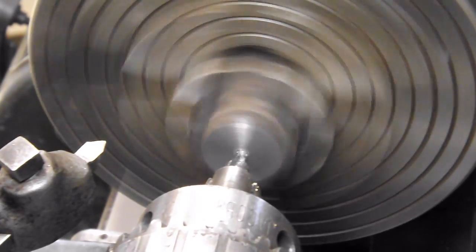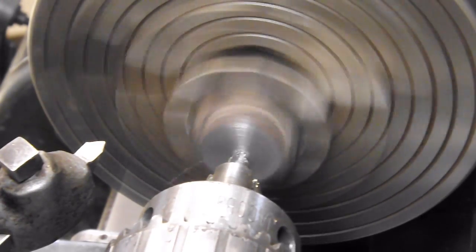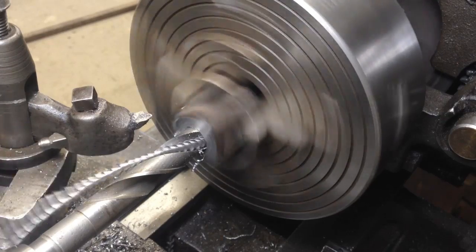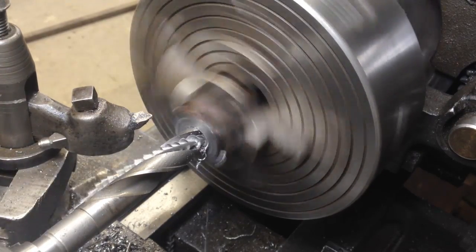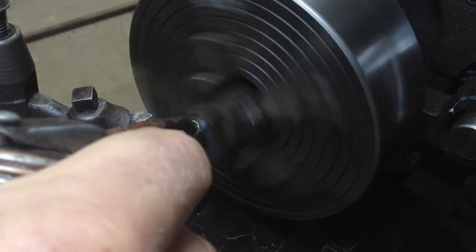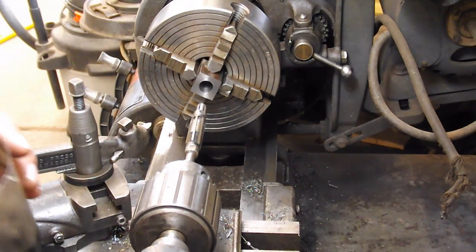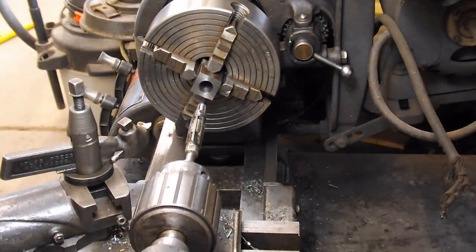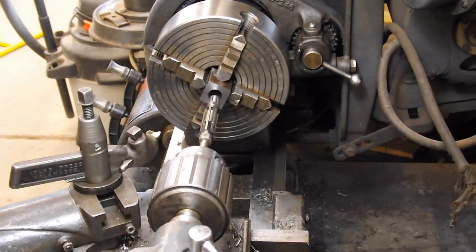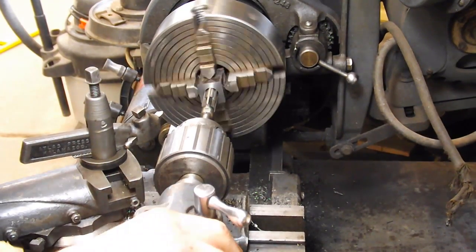Feels like a dull center drill too — really not drilling very well at all. I'm going to slow it down. Playing with these hand reamers. Let's get this up to the right size of the hole. Got it in the chuck and the tail stock — the tail stock is not locked down — and I'm just spinning the chuck by hand and pushing the tail stock in.